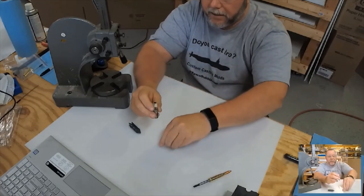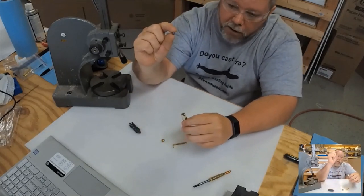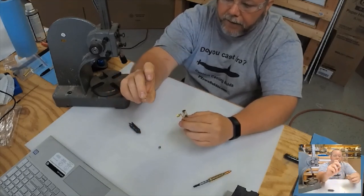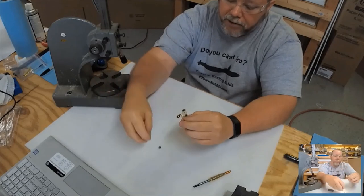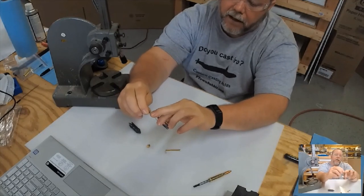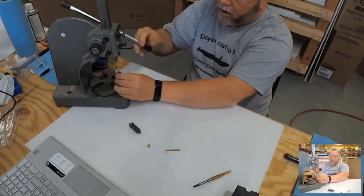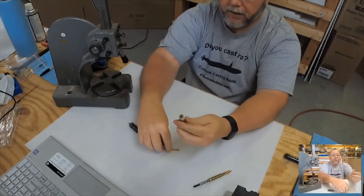Now I need to make the upper part into a blank. If you've ever made a euro pen, they come with a small nut that gets pressed into the finial — the clip goes over that and the finial screws in, giving it a round top. This has a correct side to go in first: the one with the little indentation. I set that in the end of my blank, come over to my arbor press, and press it down until it's flush.